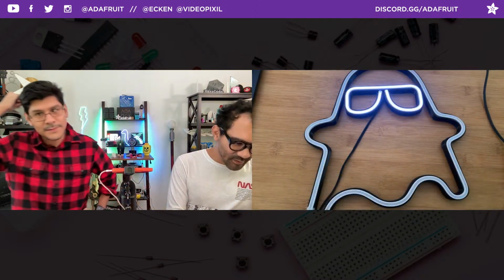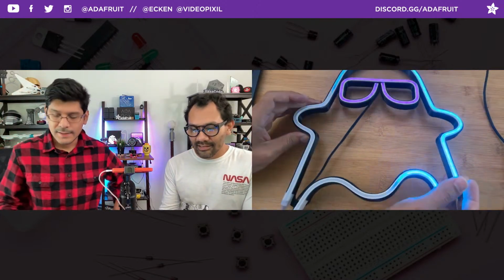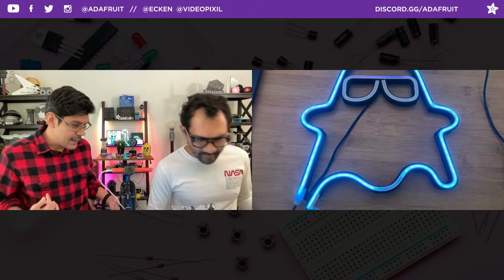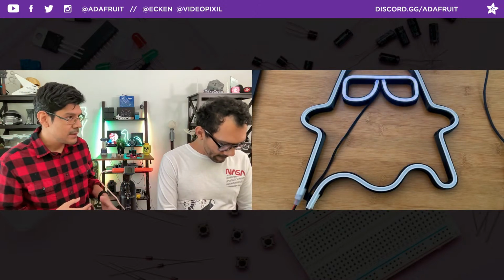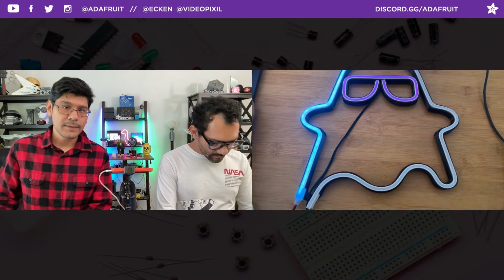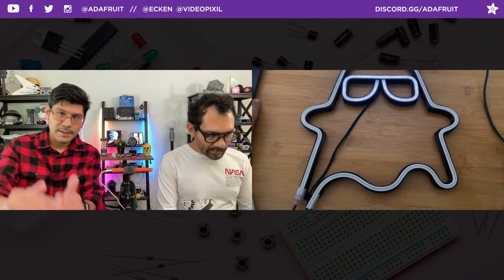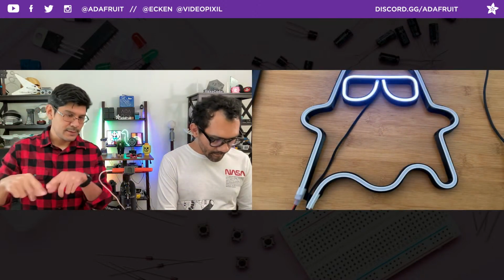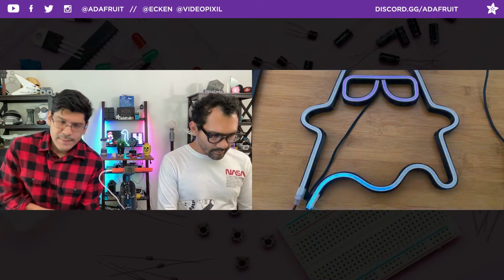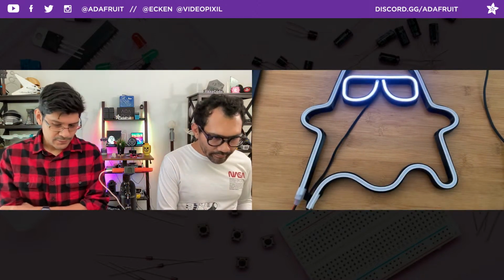Yeah. These take about 5 hours, 6 hours, 7 hours to print. They're pretty big. It takes up the full bed. It's the scale. 300 millimeters by 300 millimeters is the max of our bed, so I reduced that down to 280 by 280 millimeters. If you're looking at inches, that's about 11 inches. When I'm designing, I always make a big sketch that gives me the idea of the dimensions of my bed, and I just try to keep within those bounds because that's the max bed for these printers. It's 300 by 300 millimeters.